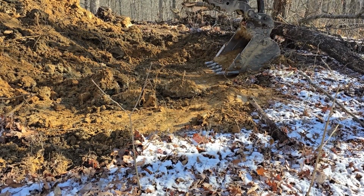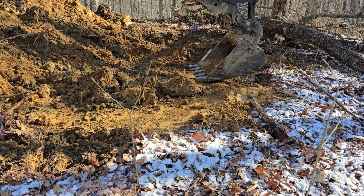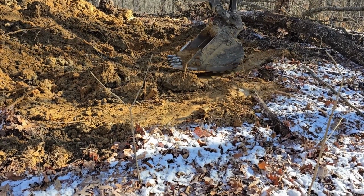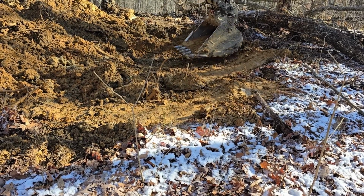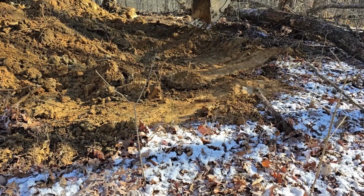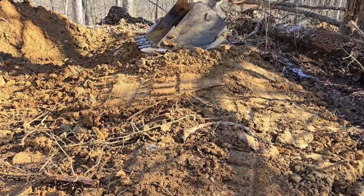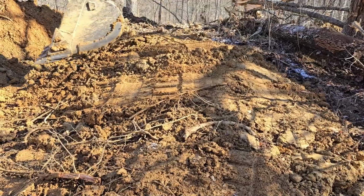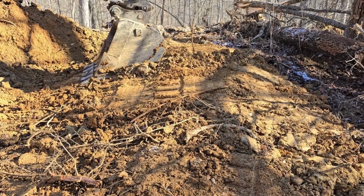The process of building this clay wedge or groundwater dam takes time. However, if you were to skip this step, the wetland would only contain water a few days out of the year. The compacted clay is built up until it's equal in elevation to the surface of the adjacent undisturbed ground. John continues to add clay and to compact this clay in layers to form an above-ground dam along the lower edge of the wetland being built.